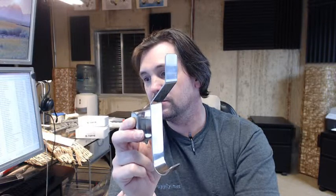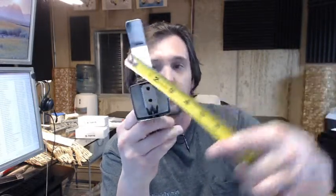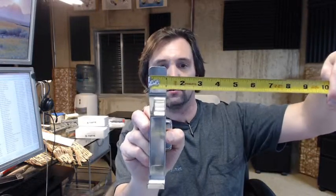Type 304 stainless — let's get some dimensions on this. The escutcheon on this is a real typical size: 2 inch by 2 inch. The overall height of this coat and hat hook is going to be about 7 inches from top to bottom. The width is 1 inch, and the projection is about 2 and 13 sixteenths — roughly 2 and 3 quarter inches from the wall to the outside of the projection.